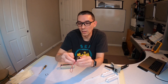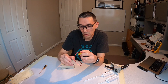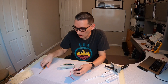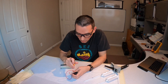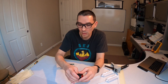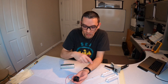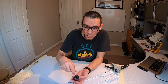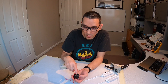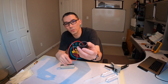So we're going to go ahead and fit that in there. Got a jam nut that we're going to slip over this, and we're going to go ahead and lock this down so this is not moving — it's very secure, very tight. It's going to get locked in, and potting compound is going to be in there as well. There are some exposed threads in there, and the potting compound is going to lock that. It's not going to come loose or come off at any point.